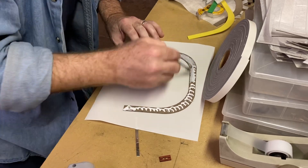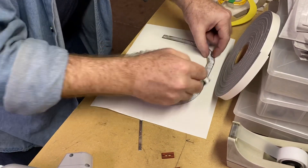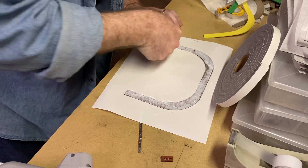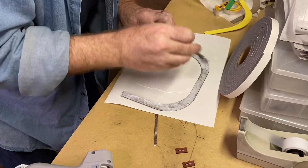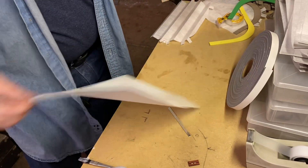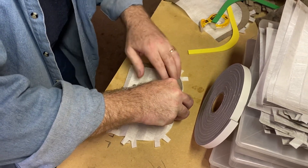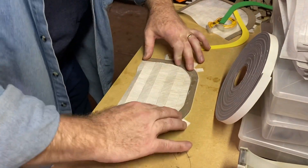In our case it's cardboard, and there's a lot of wiggle room with the adhesive used. We want to get a fairly decent coating over the whole thing — we don't want any leaks in the filter. But it does not have to be a thick coating because this material we're gluing is very, very thin. Make sure you leave brushes that don't leave lots of hair on the workpiece. Then we're going to take the filter material — I'll start at one corner, hold it down, stretch it as best I can, work my way around so that I have good coverage all the way around.